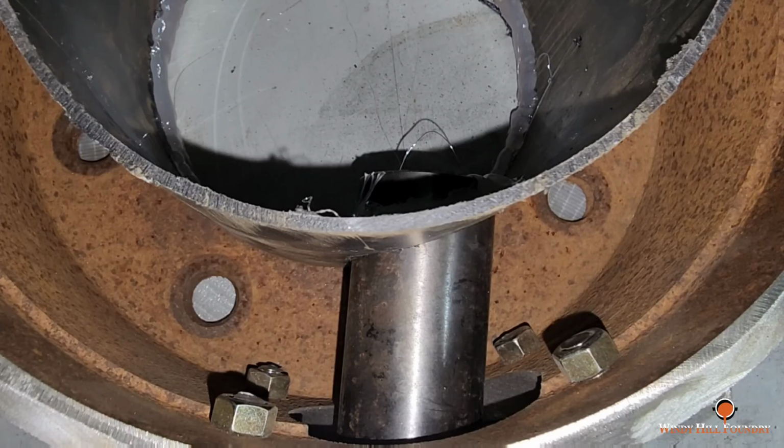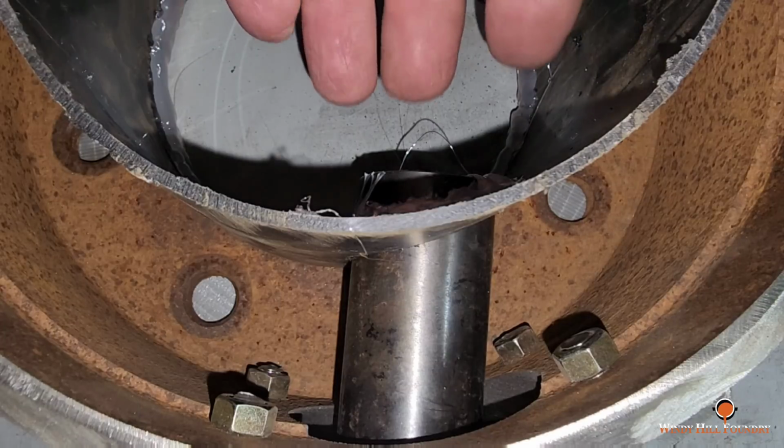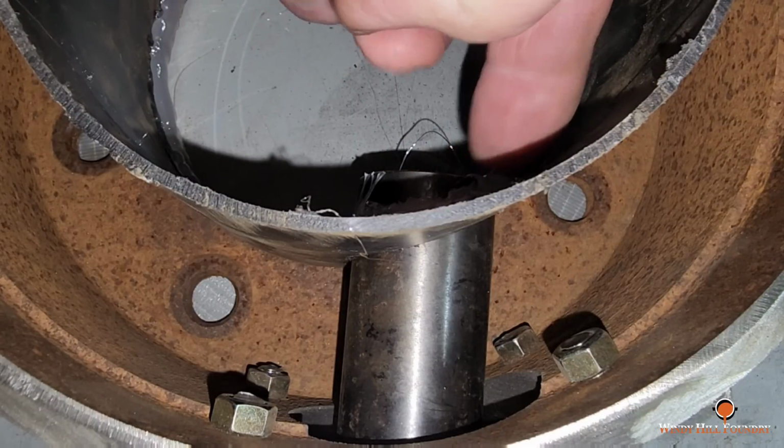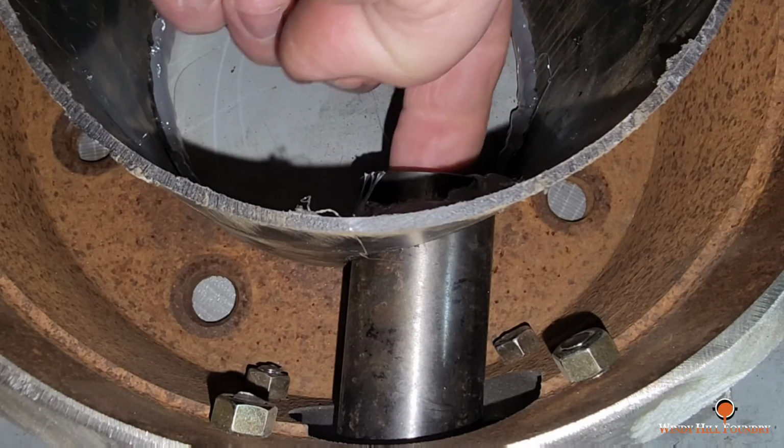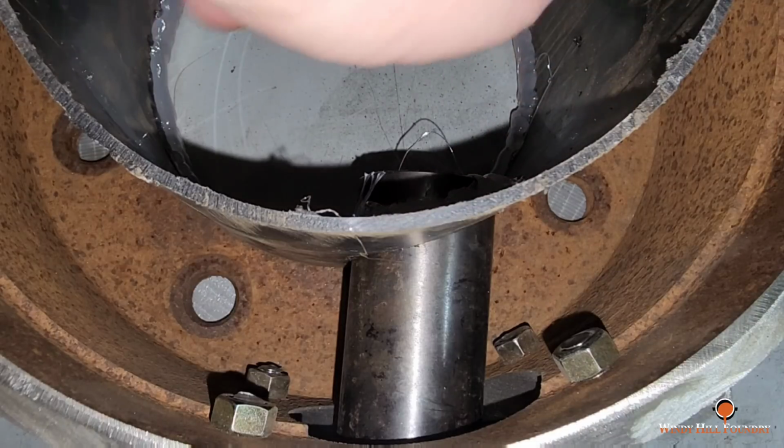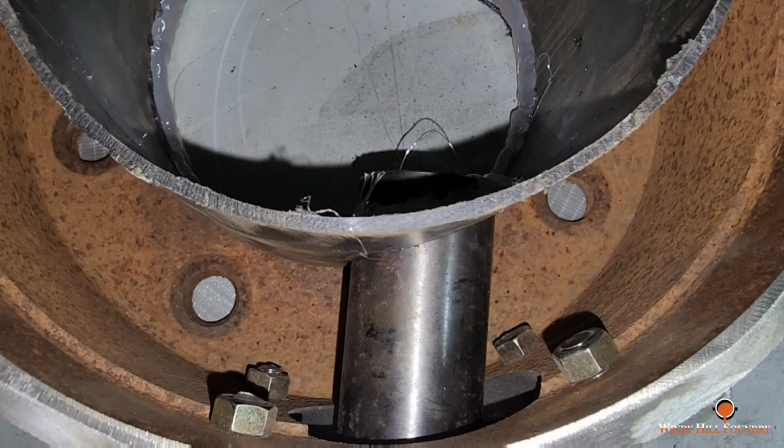I actually had one years ago that I made that was straight in, perpendicular, and it pretty much blasted the crucible the whole time, which is not recommended by the crucible suppliers, but I couldn't tell a difference on excessive wear from one side to the other. It didn't seem to faze me. Just for tradition, we will tilt it a little bit, and I'm going to also increase the surface area here and leave this a sharp point, so that will help draw that. It's a low pressure. It'll pull that current around and help whirl it around better anyway.